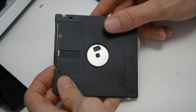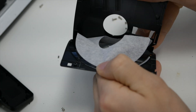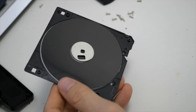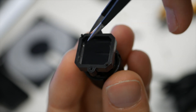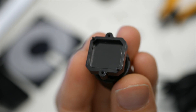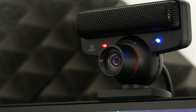Next is where that floppy disk comes in handy — you'll need to do this for both types of camera. Floppy disks have visible-light-blocking properties, so open up your floppy disk, find the actual floppy part, cut a piece off it, and stick it right here in the lens housing. Just cut it down to size so it fits nice and snug. Then reverse the whole disassembly process — put it back together — and find a decent place to put your camera. The hardware side of things is pretty much done.